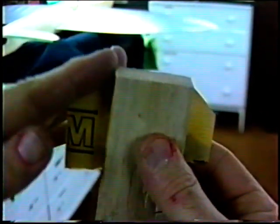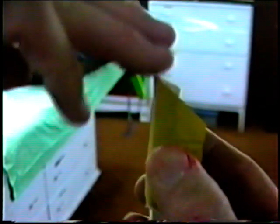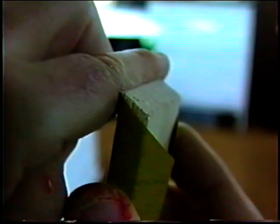So now if you just clip the sandpaper on both edges like this, what this allows you to do is, when you're sanding in a 90 degree angle, you don't have that flap of sandpaper chewing up the other side. And the sandpaper that's already on this block holds this right in position real nice. So that's about the right angle right there too for doing these fillets.